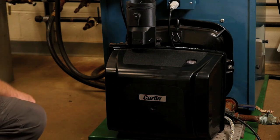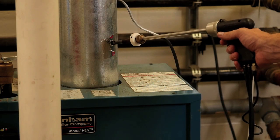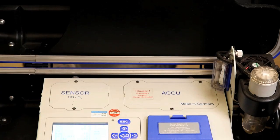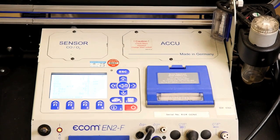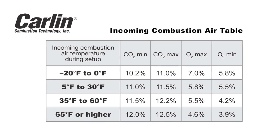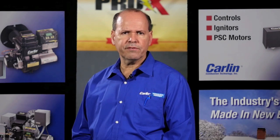The oil burner is now ready to operate. Since adding a cover and a ducted air intake, the combustion characteristics of the appliance may change. So it is important that a combustion test is performed to ensure proper operation. Outside air for combustion will fluctuate by season and will significantly impact combustion. Use the table based on outside air temperature at the time of setup to ensure proper burner setup. When testing combustion, always reinstall the cover after making adjustments. It is sometimes necessary to repeat this process more than once for proper setup.